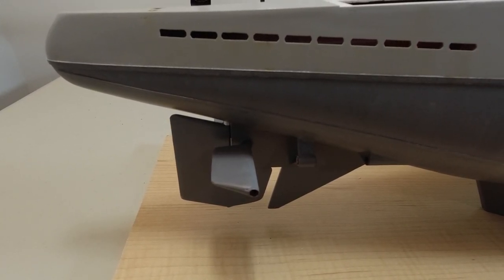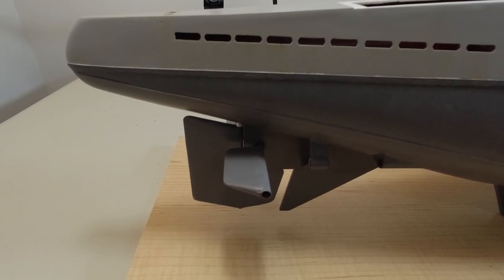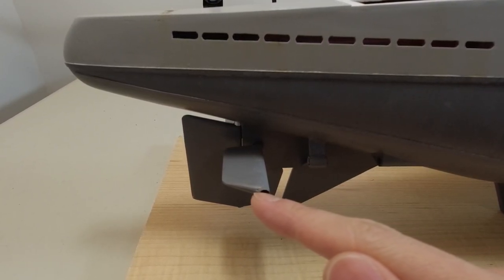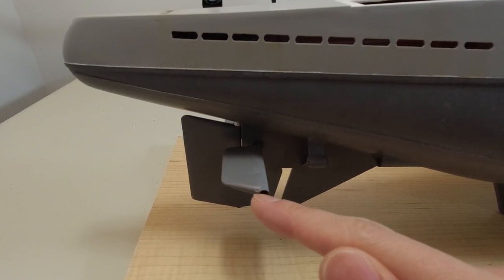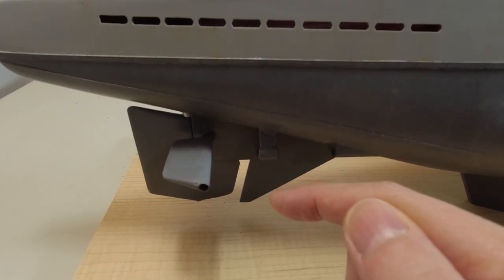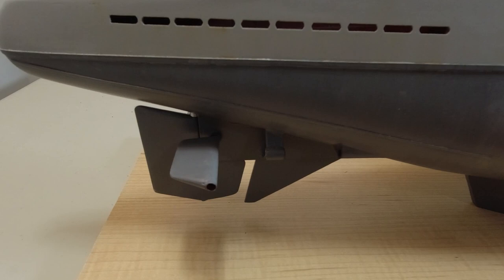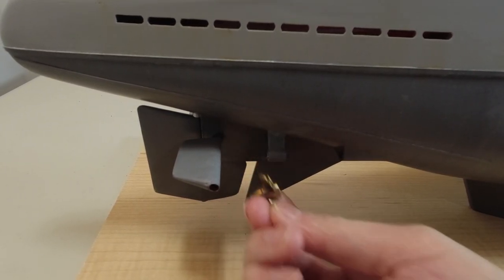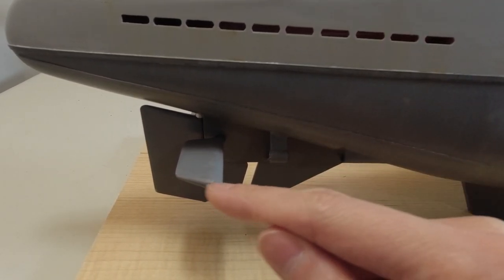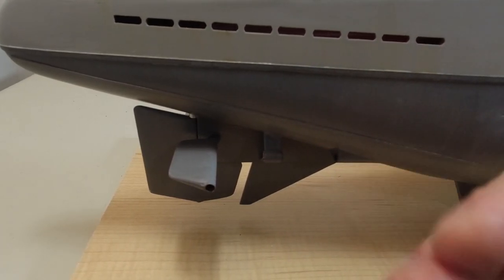For the diving planes I think I've got maybe a maximum of three degrees on either side up and down, and the reason for that is they're going to be sitting right behind the propeller wash. With the amount of water current generated by the prop, you really don't need too much travel on the diving plane itself. At the depth I'm operating at, what I have is plenty enough to make the submarine pitch up and down. Also missing right now is the propeller guard — an L-shaped piece connecting the edge of the diving plane to the prop shaft support — but I'll have that made and connected towards the end of the build.